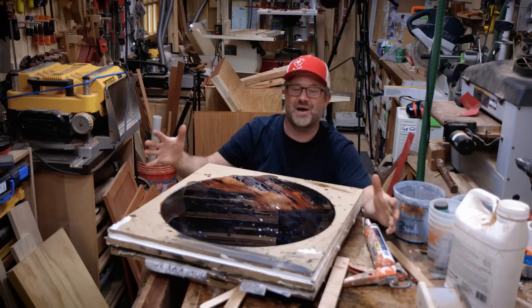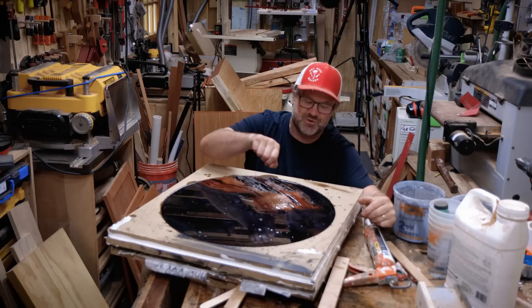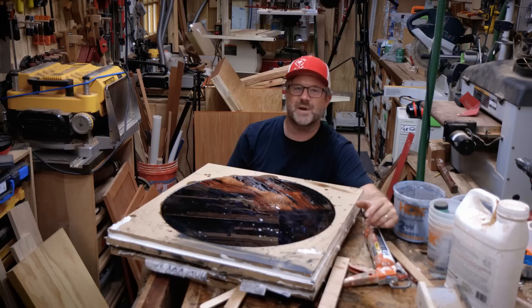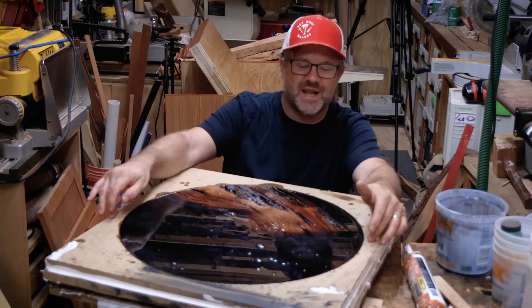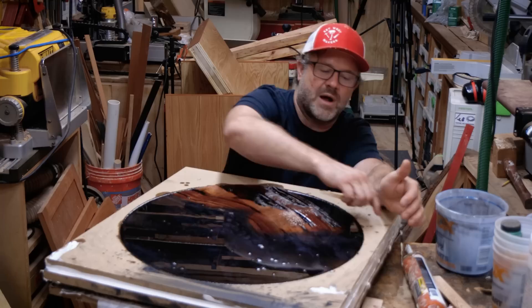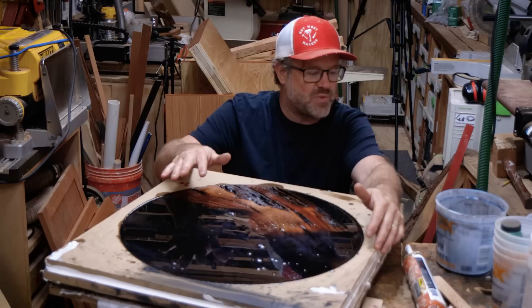It's not expensive carpeting — it's a shop — but I was a little upset. More than anything I was just hysterically laughing at the incredible mess the epoxy had made everywhere, and wondering how the hell I was going to clean it up. I managed. I waited about six hours until morning when it was semi-hardened and goopy, and I was able to scrape it off just about everything except the carpeting — some of which is forever epoxied to my wooden subfloor. In hindsight I should have caulked between each layer before sandwiching. After finding it leaking I put caulk around the entire outside at the seams, which seems to have done the trick.